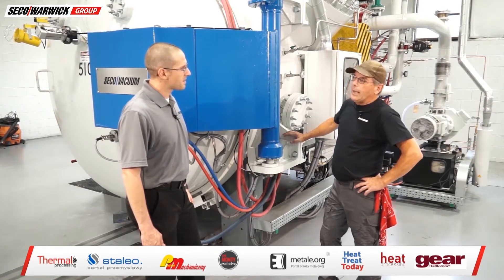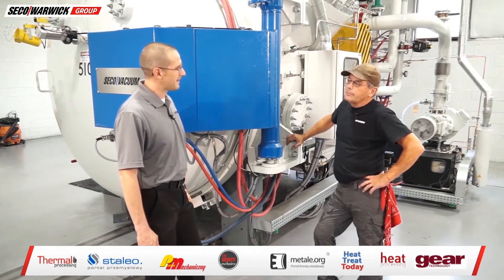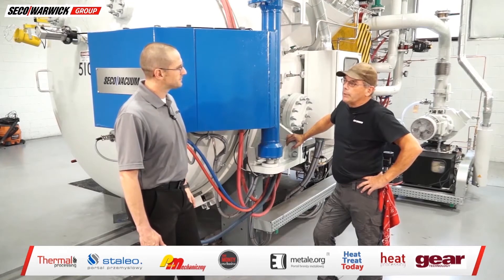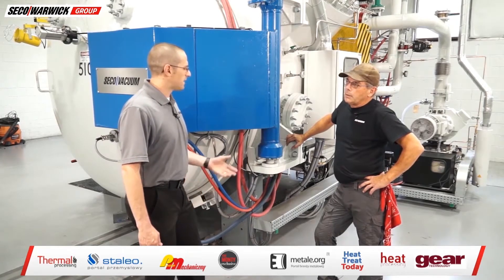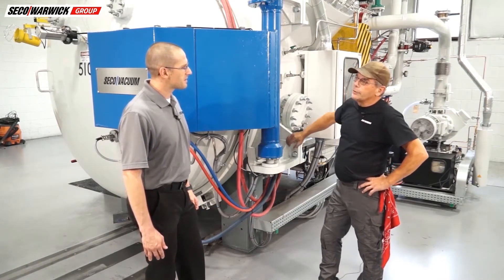They had a good leak-up rate the week before, then they do the maintenance and then they don't have a decent leak-up rate. You think it's something we'll need a leak detector for? Yeah, of course. We'll need the helium pressure regulator and the gun for spraying the helium.